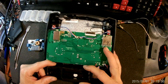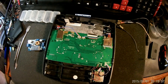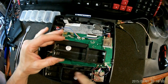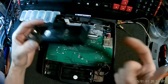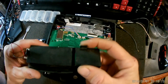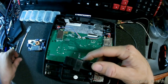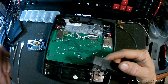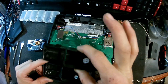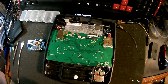Now this battery compartment can be removed. I actually own a second transmitter and I've already done a mod on it — this is the battery compartment removed. You can remove this very easily. There are a couple of clips down here, and if you slide something flat — a guitar pick, a flat screwdriver, a butter knife — you can unclip this and pull the whole entire box out. That will allow you to have a much larger section for your batteries.